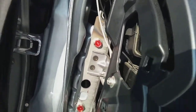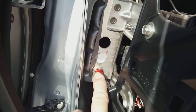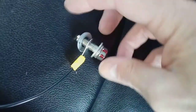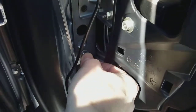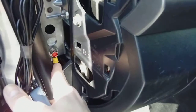That reveals some nice bolts you can use for an earthing point. Go ahead and take this bolt out — don't worry, the dashboard won't fall out, it's held with plenty more. We're going to pop our earth terminal behind this bolt. Minor correction: that's a 12 millimetre bolt, not 13, but either way remove the bolt and we're good to go. With the bolt removed, we've put a circle terminal on the end of the earth wire, thread it over the bolt and pop the washer behind it so when you tighten it back up it doesn't crunch the earth connection. Pop that back in for a nice solid earth.